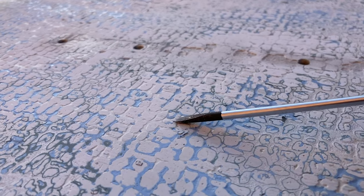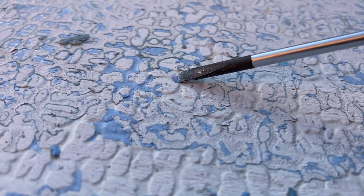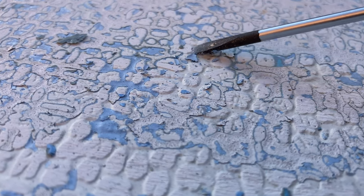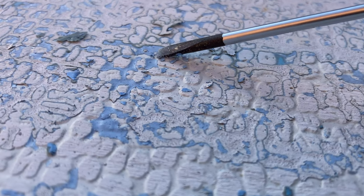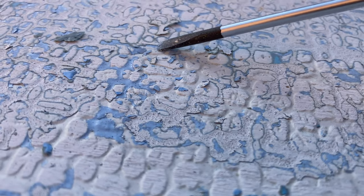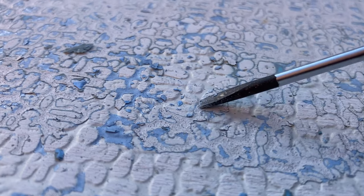I'm not putting 180 pounds worth of Kiwi grip down on top of this, that's for sure. What I'm gonna have to do is I'm gonna have to sand this flat. Even here, blue, that's actually a paint. So it's a blue paint on top of, you've got white on top of blue there, and you've got the blue on top of the white, which the white is the molded in gel coat.